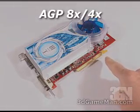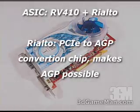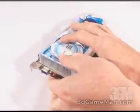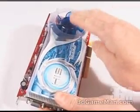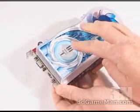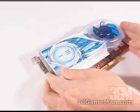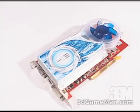This AGP video card is based on the ATI RV410 chip. The cooler on this card is quite large and is comprised of a plastic top with a blower-style fan. This fan pulls in cool air and forces it across the heat sink, then ports all the warm air outside the case. It's an excellent design that works very well and is used on most HIS video card products.